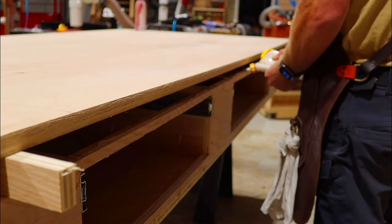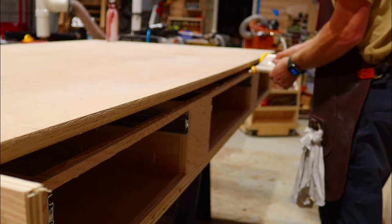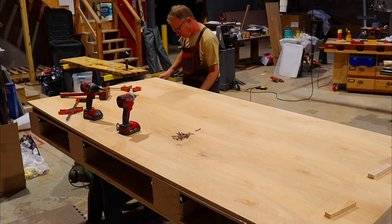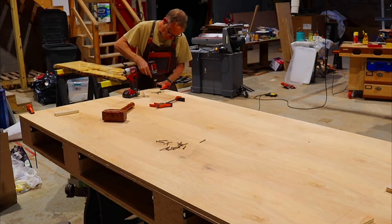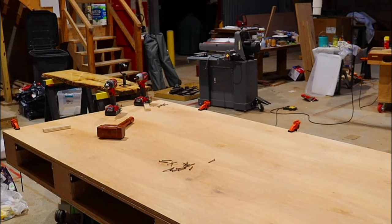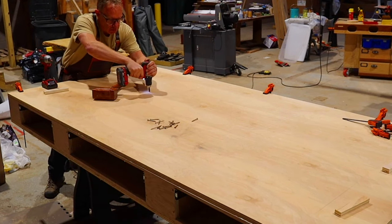It's a pretty exciting moment. Everything had been done — it was time to actually put the bottom onto the carcass. I took some spacers from scrap plywood to keep it up off the carcass. I had already placed glue on the actual grid structure and ran beads of glue all the way around. After I was satisfied there was glue on everything, it was just a question of removing those spacers and laying the bottom down on top of the carcass. I made sure I had clamps at the ready and started working to make sure everything was square. It was out here or there, and a quick true-up with a belt sander took care of some of the overhang.